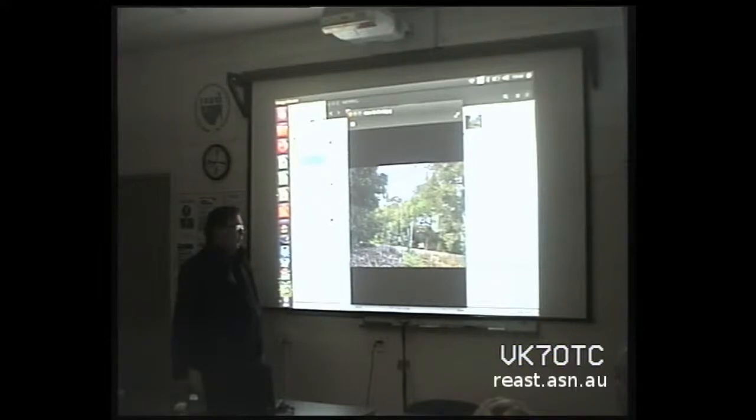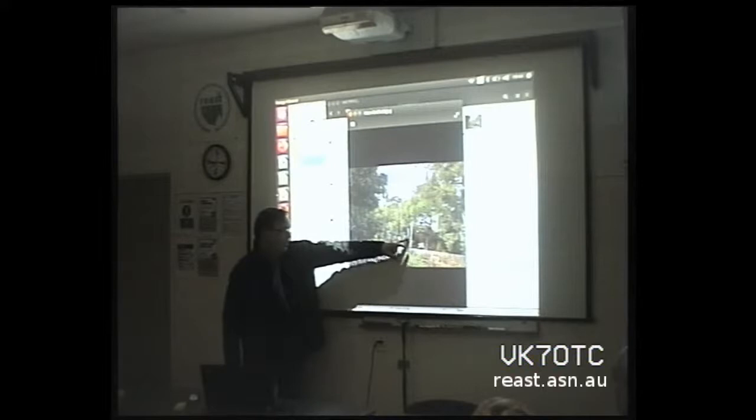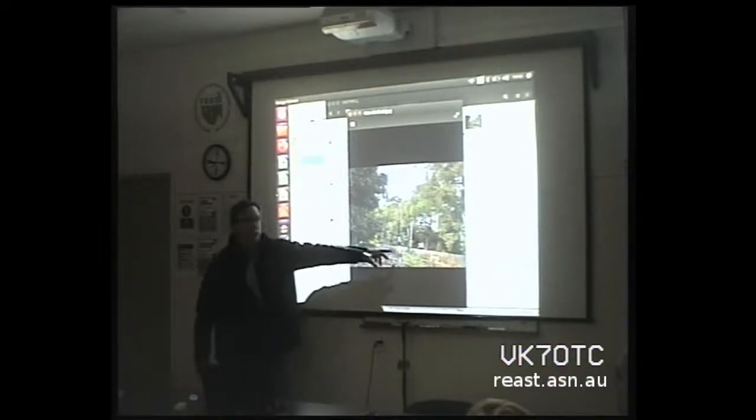And they're all pretty much the same, but I believe this one is horizontally polarized if it's 2.5 meters from this point here, and correct me if I'm wrong because I forget things. So right about there, the pictures aren't that great, right about there, there's that blotch where I tie in with the standard 75 ohm coax, it's RG59. So it's just a 6 meter length of 59, and that ties in there.